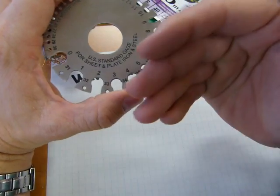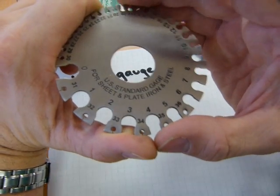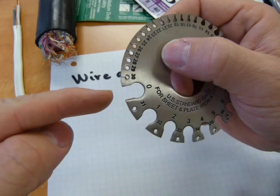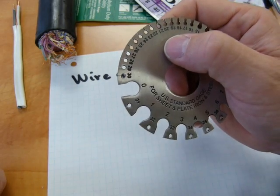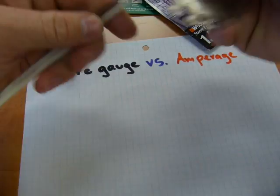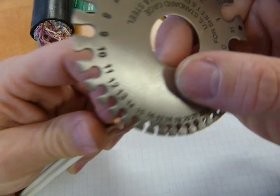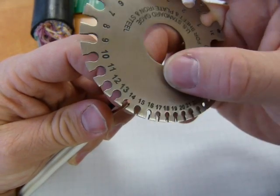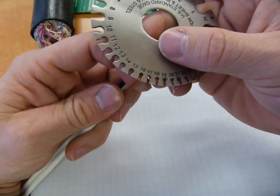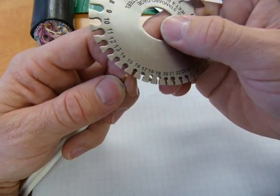It's like British shoe sizes versus American shoe sizes — human feet are human feet, the numbers are just a little bit different but it's the same idea. Here is a wire gauge tool; this is how wire gauges look. You can see 0 being the biggest wire. The wire would need to go through the gap and you would check its diameter. Here is 14-gauge wire, and if I wanted to check its gauge, I would see how it passes through the gap — it passes through 15 on this sheet metal gauge, close enough. It doesn't go through 16 or 17 or any of the smaller ones.